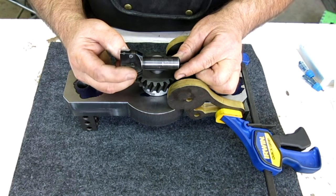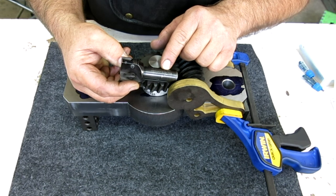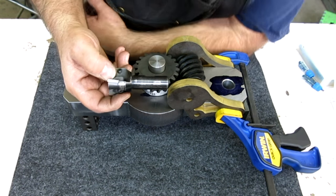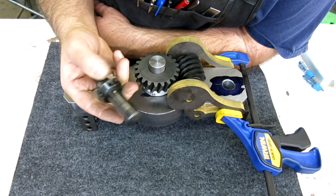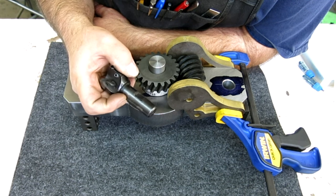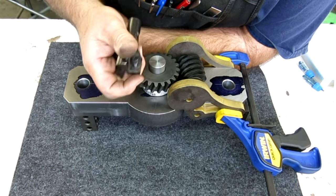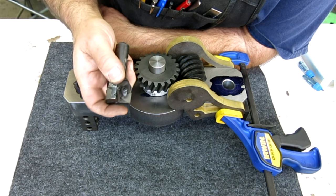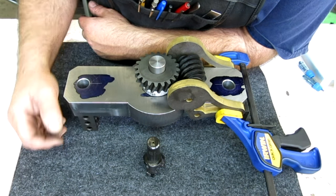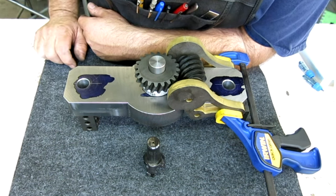For those of you guys that, this is a Ceratip MTP-90-150-75W, Ceratip. They're a little bit hard to find. I don't know if they still make them anymore. I've had this maybe 25 years, something like that. It works great, and it uses these TPG 322 Cermet inserts, and it just kicks Bob's your uncle's butt. So anyway, let's go drill and tap these holes and get this mounted up, and let's go.